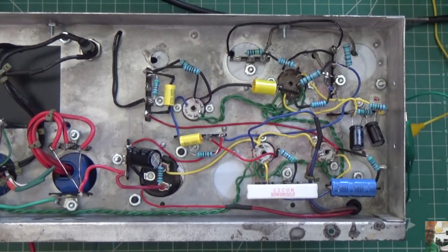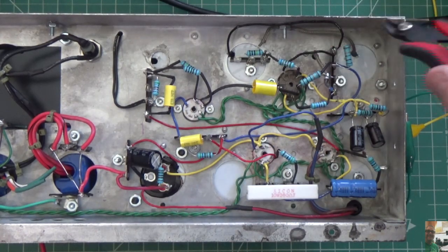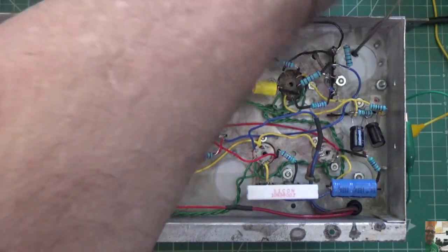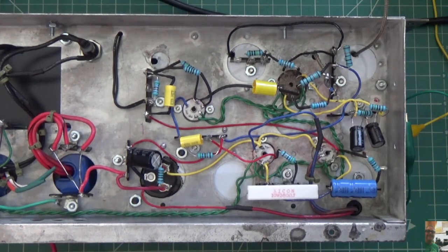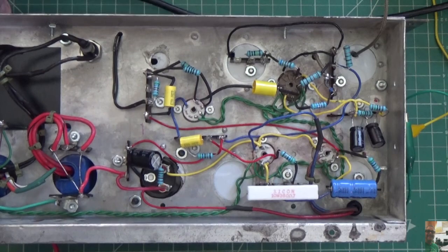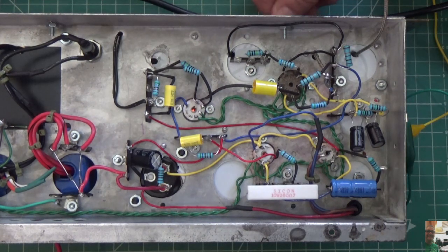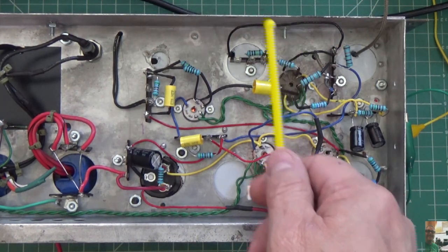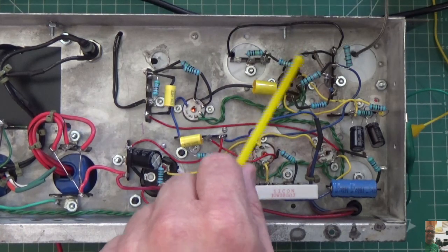So in order to test our theory, the first thing we're going to do is cut this wire that comes up from the top — this is the wire that goes to that input jack. I'm going to cut the wire right there, pull it out like that, and leave it right there. We're going to turn this amp on and see if those resistors are still microphonic. Amp is plugged in. Power is applied. Let's give it a minute to warm up. I just turned the volume up and it's still squealing.